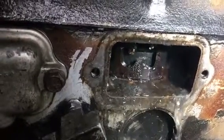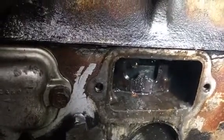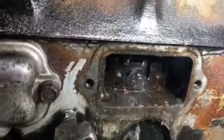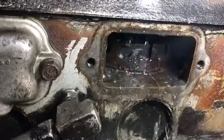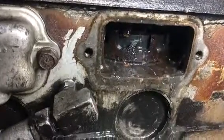So we're gonna pull the heads off. It's got cylinders down on both sides — this engine got overheated. Number two on this side and then the third one on the other side. I don't know what the firing order is on it, but those are down. This is gonna be a busy day today diagnosing this 8V92T. Just impressive to see that liner.